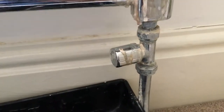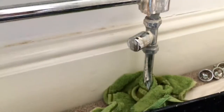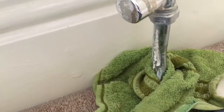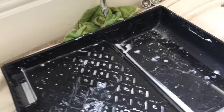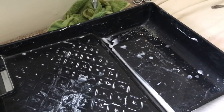Right, we've drained the system down and loosened the valves on both sides. Now we're going to unscrew the radiator off the wall. When we've released these brackets, the radiator is going to be just balancing on these pipes, so I'm going to have to grab it. There's usually going to be some black water in there — a bit of green towel on that side, purple towel on this side, and something to drain into to get the last dregs out. You don't want that black stuff on your carpet because trust me, you never get it out.